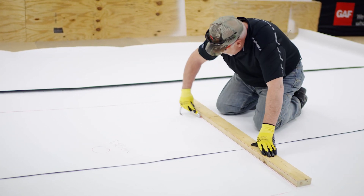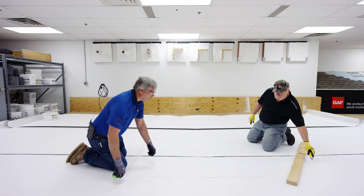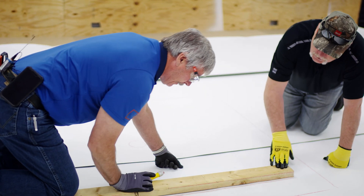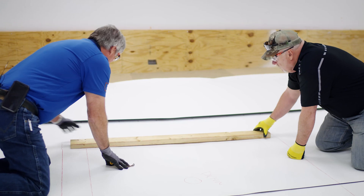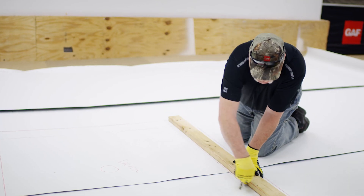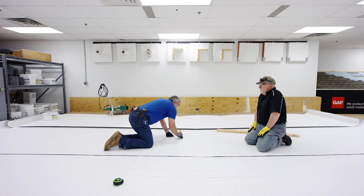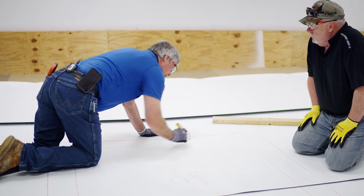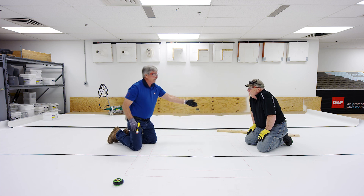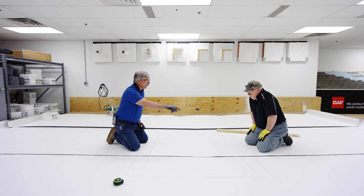So you don't want to cut right at the edge — you need to go six inches beyond. Now, would you want to snap chalk lines on this? You never snap chalk lines on TPO or PVC — chalk lines are just a mess. The lumber crayon is easily cleaned with our cleaner or 409. Here's where our fasteners are going to go. The fastening pattern for your base attachment would usually be 12 inches on center, and that gives us at least two to three inches beyond our plate and seam — minimum two inches beyond so we can actually weld the target around there.